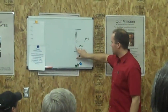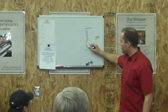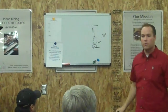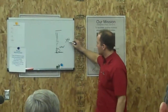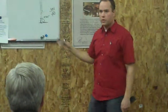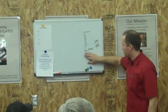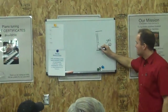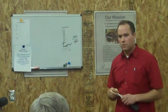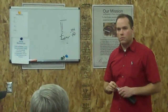Okay, and the third way, which is the key dip, let's say you have let-off here. If you take some punchings out, you could have your 80 thousandths right here, but then you introduce a problem here. Now instead of 394, you've got 450. So you know you don't want to do that. So that's a no-go. So is it making sense?